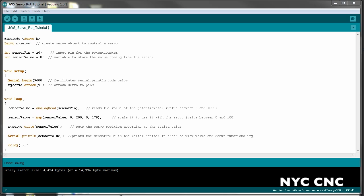Let's take a quick look at the code. Most of it is commented, so I'm not going to go into great detail. The sensor pin equals A0 — that's analog pin 0. This is the input pin we'll use to read our potentiometer. We're using the serial monitor, which will let us debug our code and view the potentiometer values on our screen. We're using the map function to translate the potentiometer into servo movement, and finally we're using the common servo.write function.